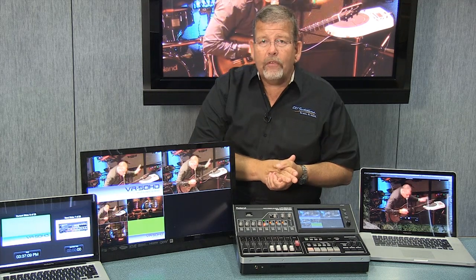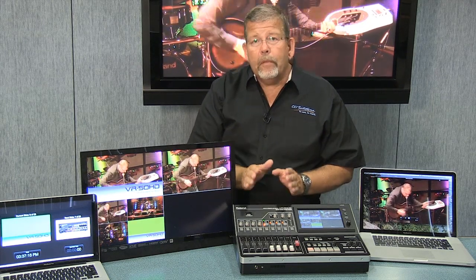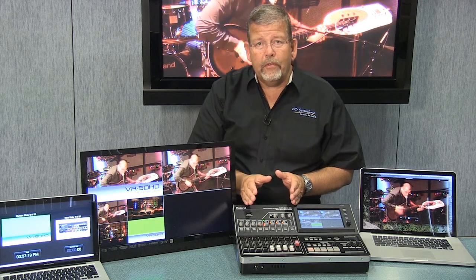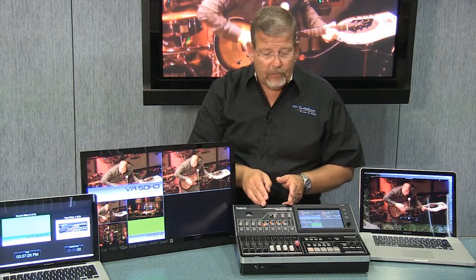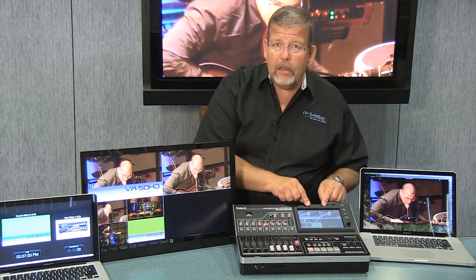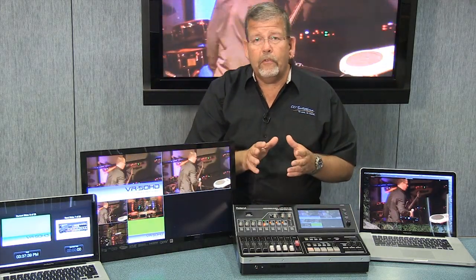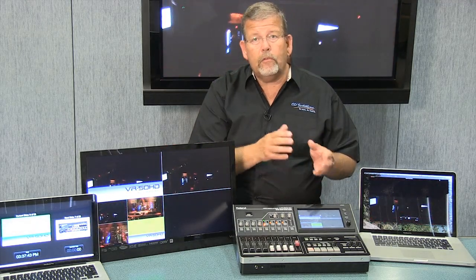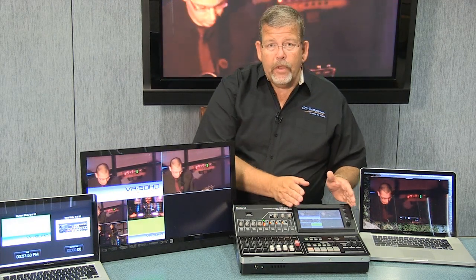There's also an additional AUX output that I can use to feed, say, a foyer monitor. It is also a complete 12-channel digital signal-processed audio mixer in the same chassis. I've got four microphone inputs and then an additional eight AUX inputs that are in stereo pairs. The VR50HD has a touchpad here, so a lot of the controls I need are right on the touchpad. I can get into the digital signal processing for the mixer just by touching that — select input signals and routing — it's all right here.